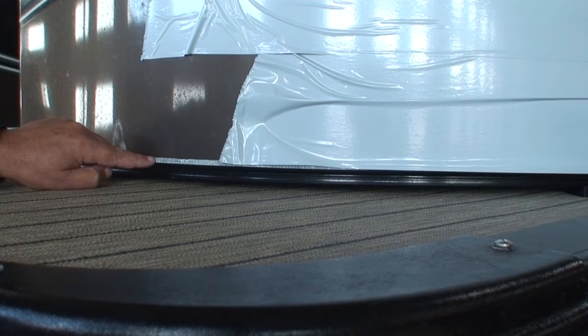Here's another little feature — notice the foot pads. These foot pads are mounted on top of the round part of the tube — that's why it's curved. Barletta welds each foot pad on both the outside and the inside of the tube, giving double the strength of the saddle bracket being welded to the tube. I have seen boats without a foot pad where this piece of metal is welded to the tube, and through the pounding a pontoon takes across the water, this sheet metal literally embeds itself down into the tube, creating leaks and cracked welds. That's why Barletta uses a foot pad on the bottom of their saddle bracket.